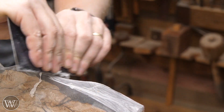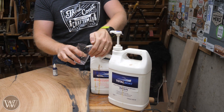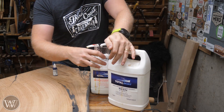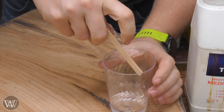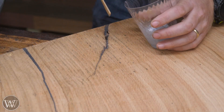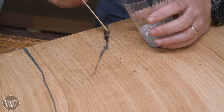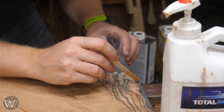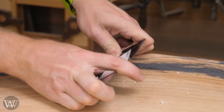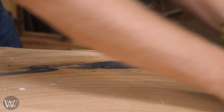You can see some of these places coming off really nice and glossy — it chisels really well. Bring in the spokeshave, run it down, then bring in the card scraper to do the final detailing and you've got a nice smooth surface. We're going to be doing more polishing on that in the future, bringing it up to a nice glossy surface. Next up, there are a few bubbles that were in the wood — the vacuum bags didn't suck everything out. So I'm using the high-performance epoxy because it cures much faster, in a few hours versus a couple days. I mix in just a little bit of the metallic and fill in any of these bubbles. There were really only five or six per slab and they came out pretty quickly with the card scraper.